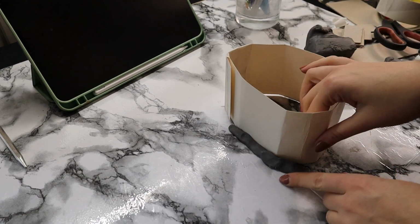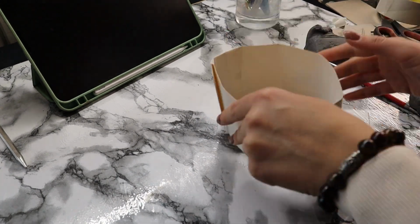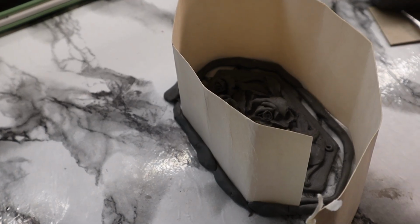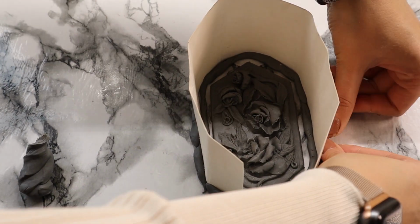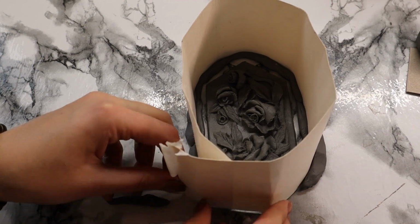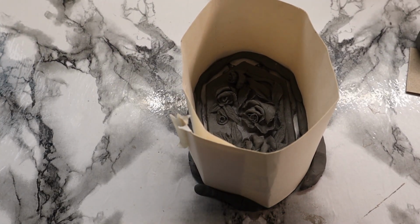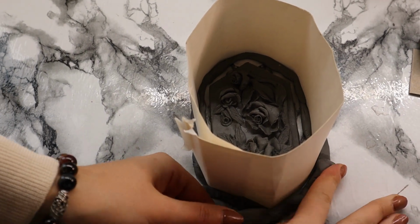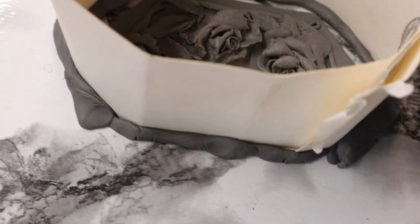After the bas-relief is done and all the cavities are filled, we can start to build a formwork container for the silicone mold. I used a soft cardboard and 2 layers of non-dry modeling clay to prevent silicone from spreading. It took me 1 hour and several attempts to create this form.